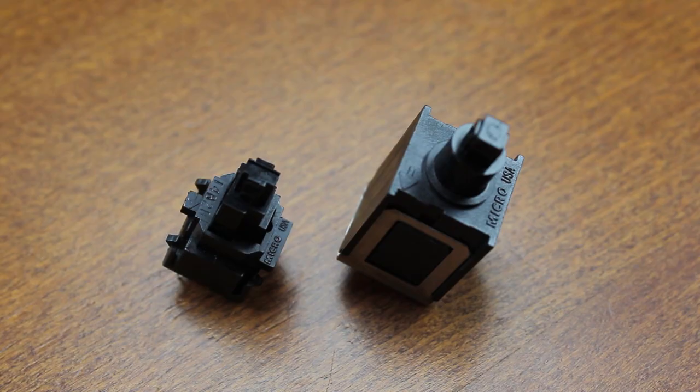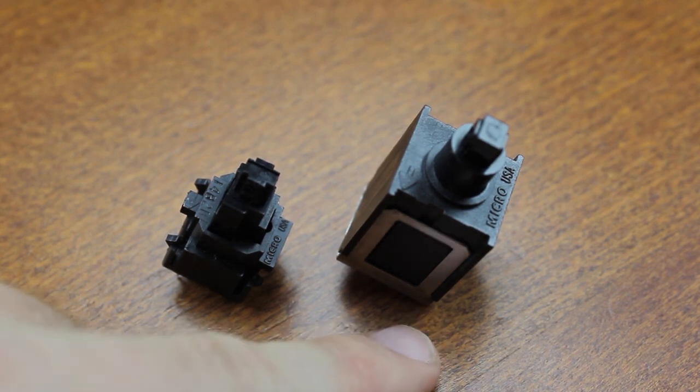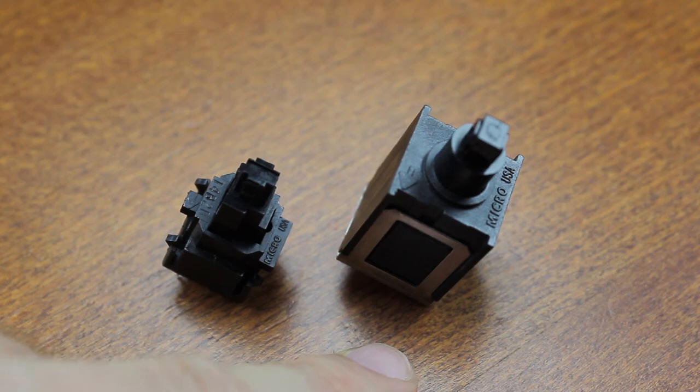The SW series is the predecessor to the arguably more well-known and common SD series, which uses only a single magnet, hence why the switches are popularly known as dual magnet and single magnet, or sometimes first generation and second generation Honeywell Hall effect. Although I've covered the single magnet switches before, these dual magnet ones are really different.